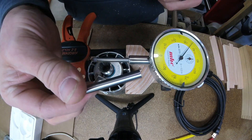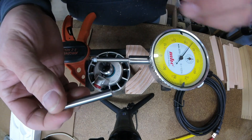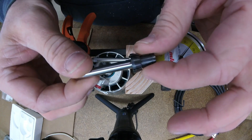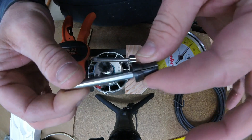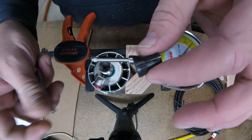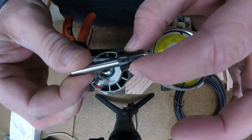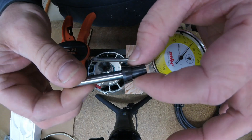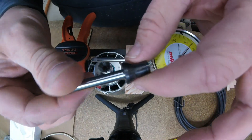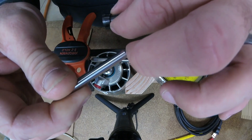Make sure there are no burrs on the backside, same thing on the inside and down in the taper, and make sure it's nice and clean — no built-up cosmoline, protective oil, or anything like that. You also want to take your gauge pin — I got this one off Amazon for about five to eight bucks, they're relatively cheap, you can get a whole set or just the one size you need. Put that in there and check it. There's a little bit of a burr on here which can catch in the collet and cause runout. Any debris, burrs, anything at meeting surfaces can cause runout. I'll have to take a stone to that side and get rid of that burr — I can almost catch it on my finger.